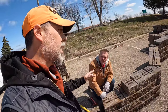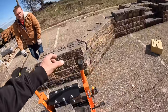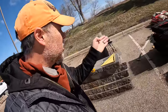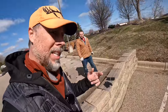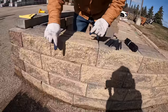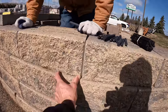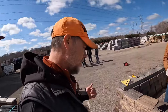You might wonder: why would we ever want to do that? Well, any time you have a 45-degree angle or especially a radius where your blocks take on a curve, that bond can get off. You just want to make sure you have four inches of overlap, because that ensures the block is pinning into both blocks below it, tying them together with the pin.